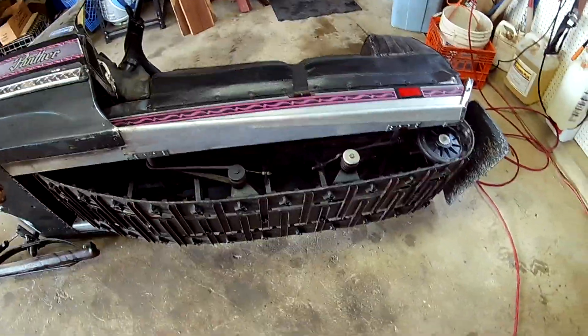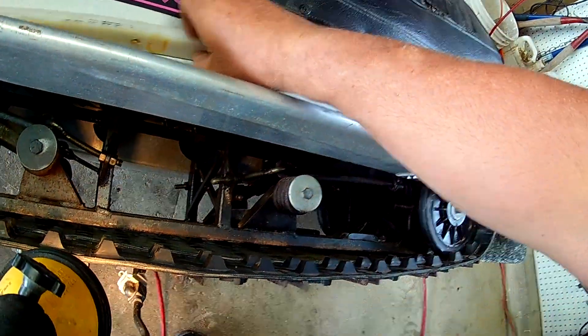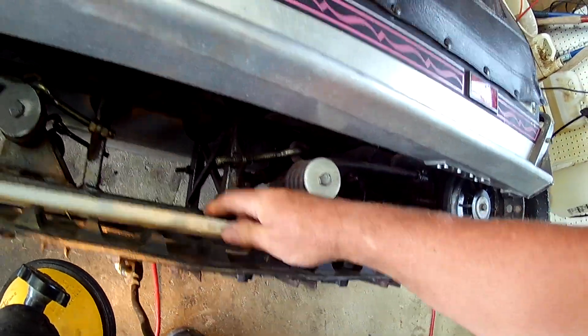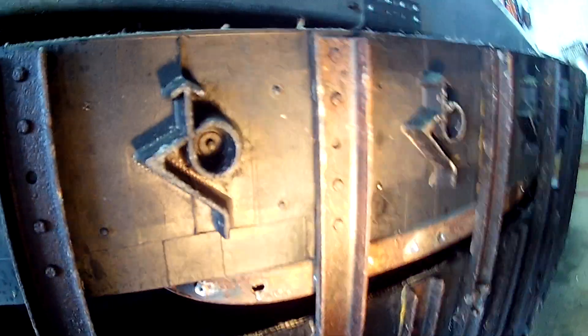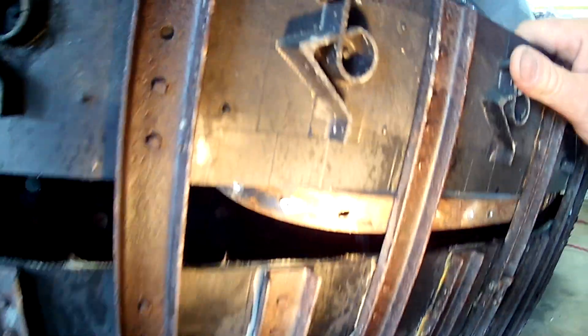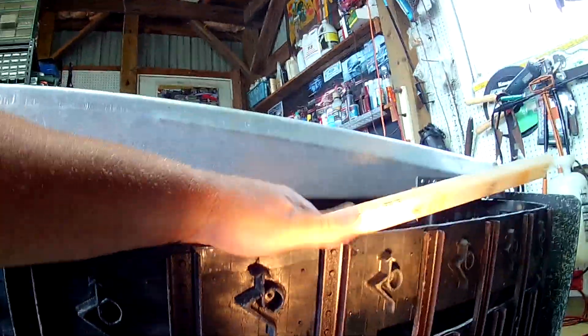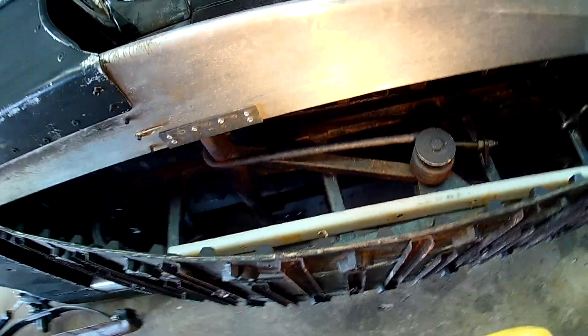These were on there the last time. The new ones will be black. Remember that little white strip in here — that's a wear bar, a slide bar. These ones pop rivet in, and a couple of these holes are supposed to be eighth-inch, but they got hogged out to quarter. There's all kinds of rivets in there. I'm going to pop rivet the new slide on there, and I'm going to repair those holes. I'll weld them shut if I have to.